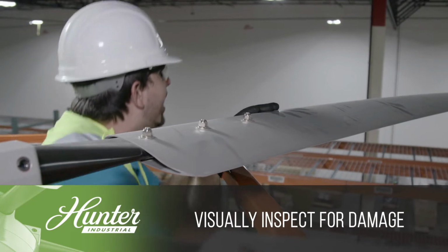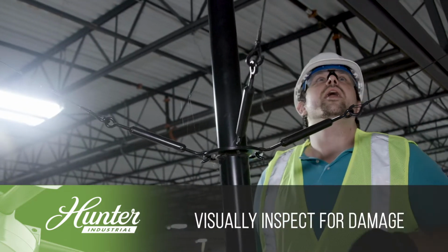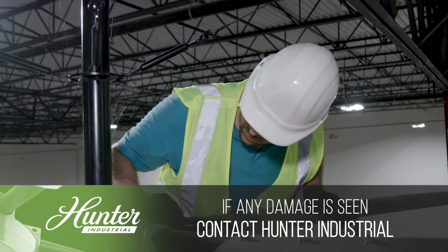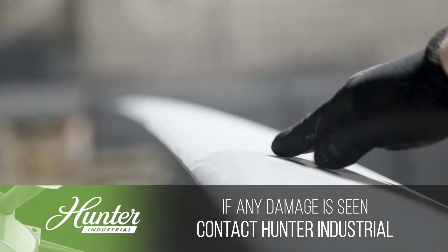Visually inspect the fan blades, motor, down rod, and guy wires for any visible damage. If any visible damage is seen, contact Hunter Industrial for guidance prior to restoring power to or using the fan.